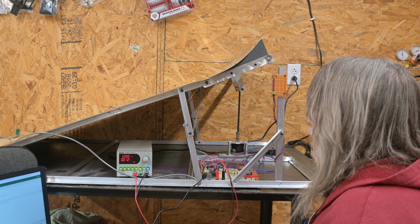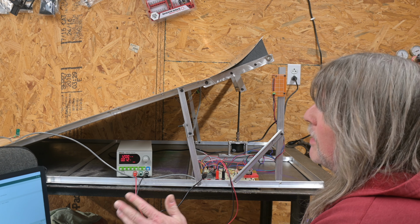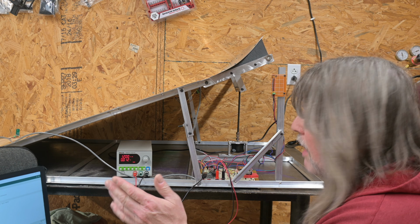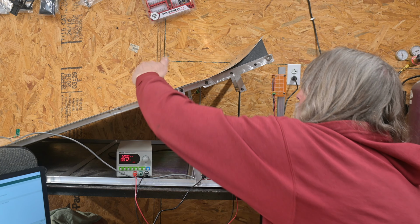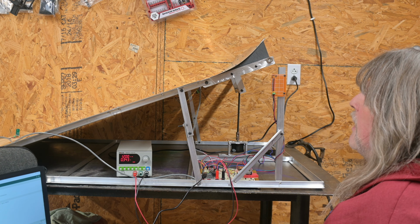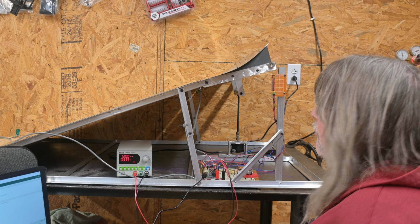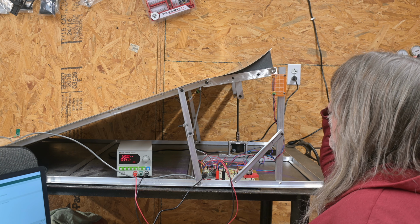But anyhow, it's actually waiting for a vehicle to come across, so I should be able to tap the ramp to trigger the accelerometer. It should come back down and be ready for another Doppler set. So let's give that a test. Okay, there we go, it's coming down. I've run it down kind of slow just so I don't overshoot the Hall effect, which is located behind this board. It's been working pretty good.